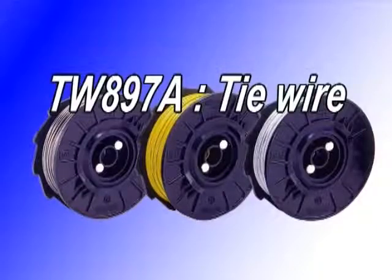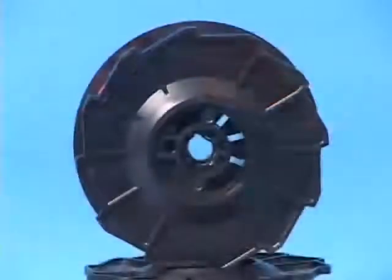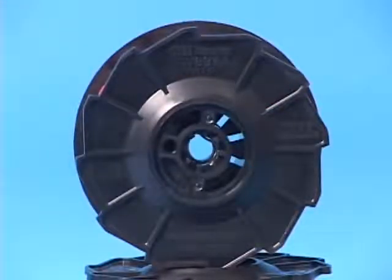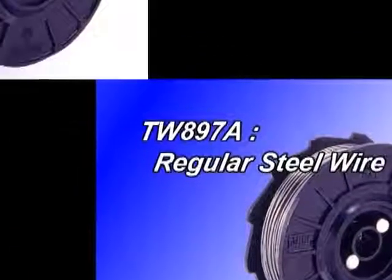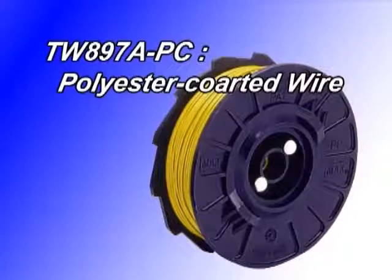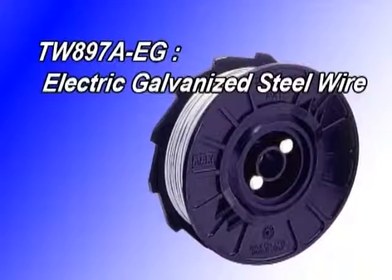Basically, there are 3 types of wire currently available. The standard type is TW897A, which is black annealed steel wire, and TW897A PC is polyester coated wire, and this wire is designed for tying epoxy coated rebars. TW897A EG, electric galvanized steel wire.